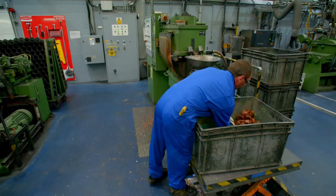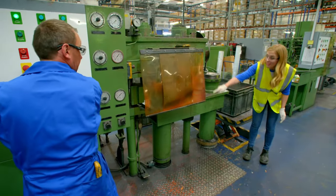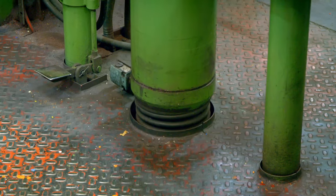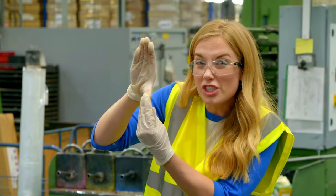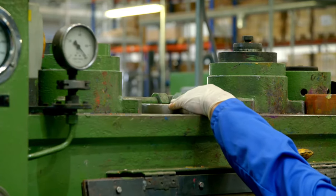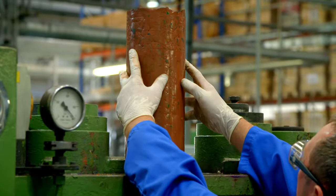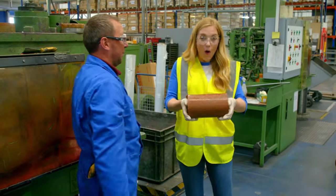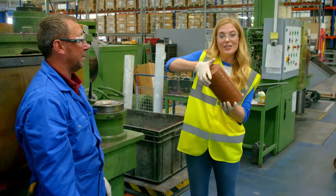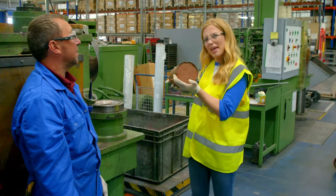Finally, to make the core, the mixture is poured into a machine called a billeting machine. Inside this part of the machine is a huge plunger that rises up from out of the ground and squashes together all of that dry mixture at the top into a cylinder shape. All of the mixture has been squashed together to make a giant core.